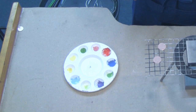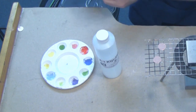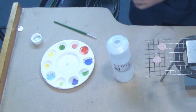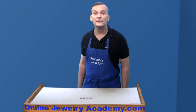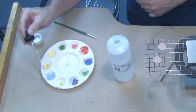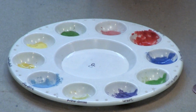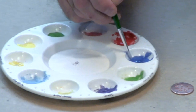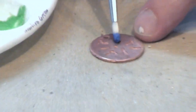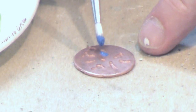To deal with the different colors, I organized them using a painter's palette, and I had previously wet the enamels with a clear binding agent called Clearfire. The palette I'm using is one I've used before and the enamel in it has dried, but it can be rehydrated with Clearfire. Using an eyedropper, I put one drop of Clearfire in the dark blue, and I really like that shade of light blue, and I decided to use the red. I can just use a paintbrush to mix the colors and apply them into the indentations. This is called wet packing. Wet packing uses the Clearfire as an adhesive to help control the application of the enamel into the recessed areas where you want it.